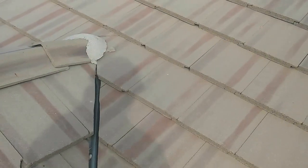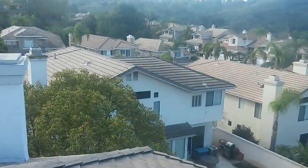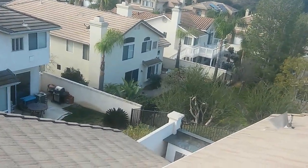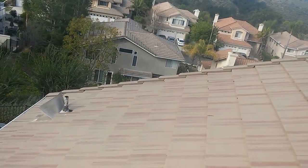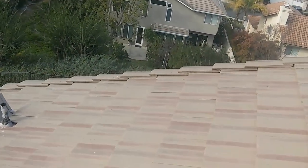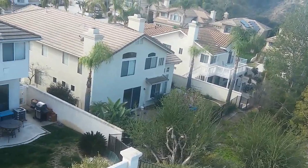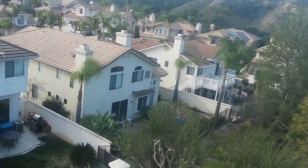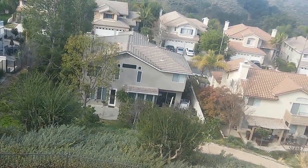When installing a flat roof tile, please do not use aluminum flashings. In this windy area, all the tile installation is the same everywhere because the manufacturer only writes one ICBO — the ICBO tells you how to install the tile. All these houses don't have counter battens because their slopes are less than 6 and 12.